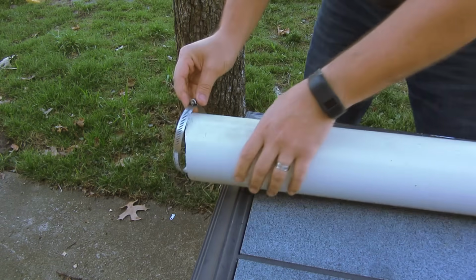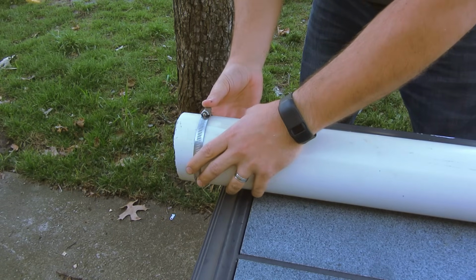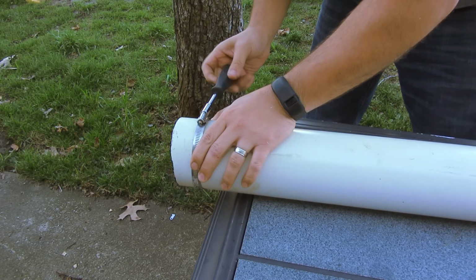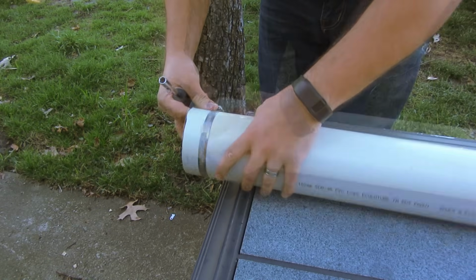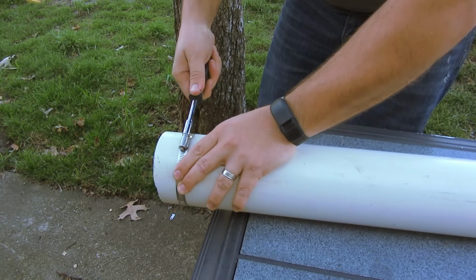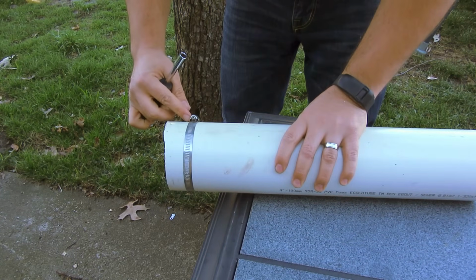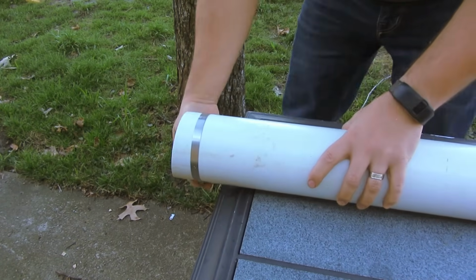Using an appropriately sized hose clamp, put it around the pipe. Keep the clamp on the side of the pipe that you are keeping. Tighten it until it's snug, but still movable. Line up the edge of the clamp to your lines. Once in place, tighten it down. Since the bolt in the clamp is a bit wider than the rest, turn that to the bottom before cutting.